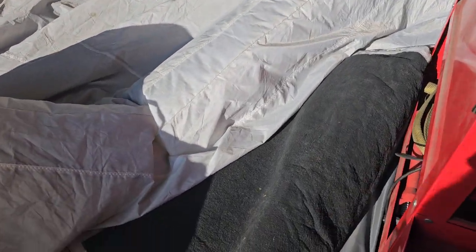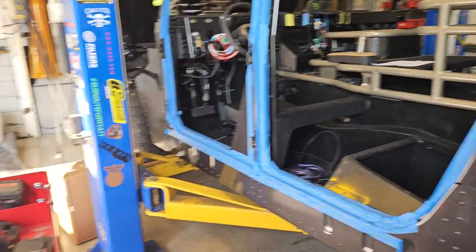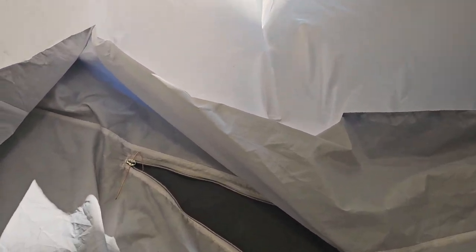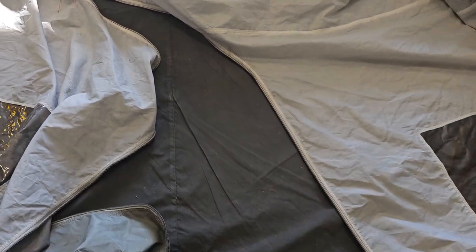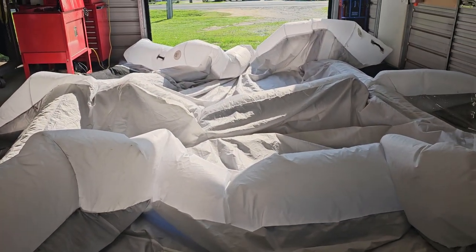A couple things I will point out — filters. The booth originally comes with a less-than-ideal filter. The filters the manufacturer sent us work great at preventing overspray and keeping the shop clean, but once they got clogged up we started having a bad problem with the zipper sticking and overspray staying in the booth. The zipper ended up getting ripped off and it's very difficult to open the door. We started trying to clean them with acetone in between until we can find a supplier for new filters.